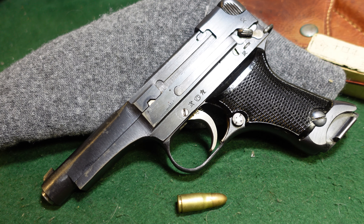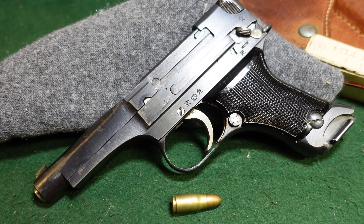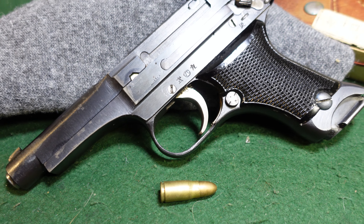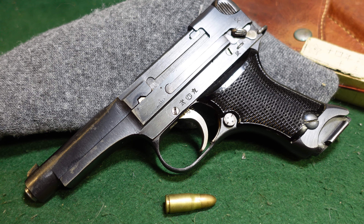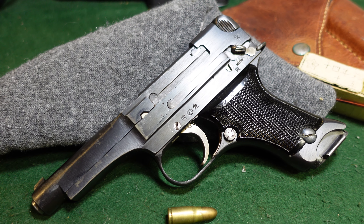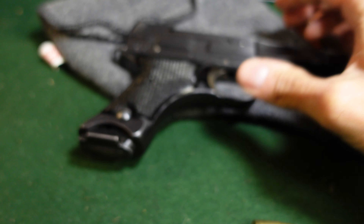The ammunition is hard to get and parts break on these guns, so repair is difficult. It fires the standard 8x22 Nambu bottlenecked round, which was pretty anemic compared to other calibers of the day — only developing about 1,000 fps. That's slow compared to 9mm, 7.62x25, or .45 ACP, which is subsonic but a 230-grain man-stopper.